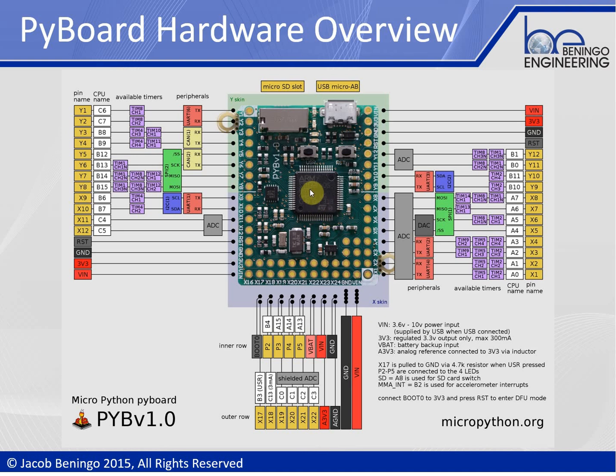The actual flavor is a STM32F405 microcontroller. The PyBoard itself has a couple of components that any developer is going to want to be aware of. The first is that it has a programmable user button, tied to a GPIO line that can be accessed through the PYB library — a library that helps abstract out the hardware and allows the developer to focus on their own application code. All interactions with peripherals and external components are done through this PYB class.